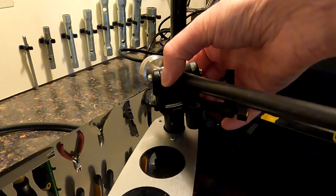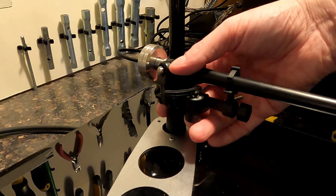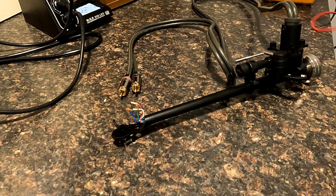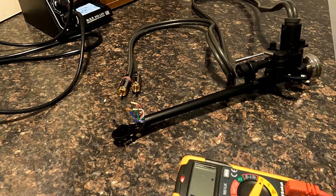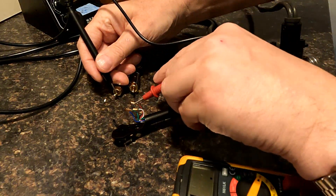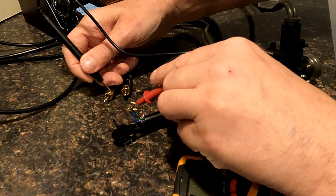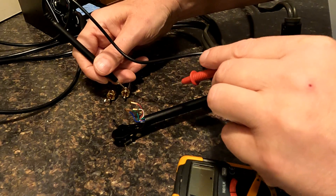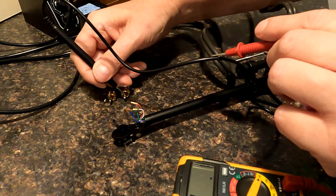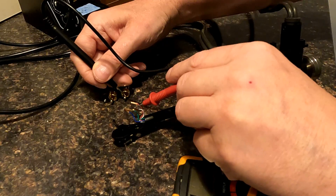Right, so I need to lift the deck up — I'll stop the camera and let's have a look at the wiring. I'm just going to check continuity from one end to the other. In theory it should be okay on three out of four connections. So right positive — my very weary-sounding continuity tester — yep. Right negative — yep. So I'm thinking this should be... yep, we're dead on left positive.